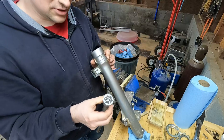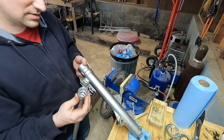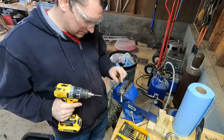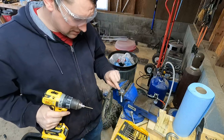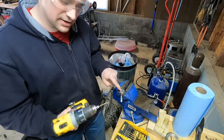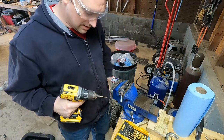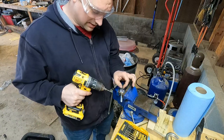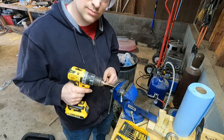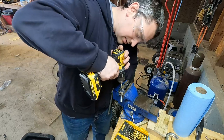I'm going to weld that on a piece of metal pipe I also got from Tractor Supply, and I'm going to show you how I built that tool so you can see how it works. I scribed a line across two places to find the center and then start with a really small drill bit. I'm going to drill a hole in this for the damper rod to come through — it'll have to be a fairly big hole, but I'll drill a smaller hole first to make sure I get it straight.